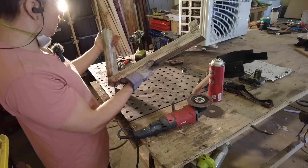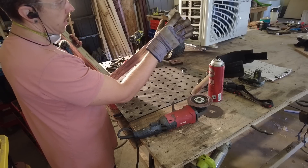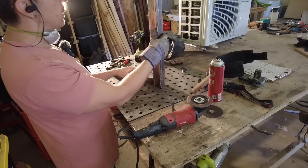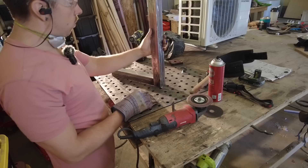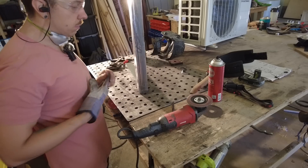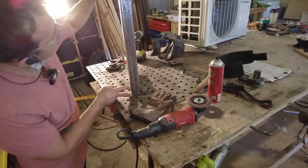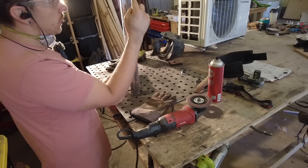This is what our completed bracket looks like — just a simple angle iron with a little backrest on the top so the unit can't flex backward in heavy wind. Now we're going to drill holes in the back, paint it, and then we're ready to mount. We'll go four inches in from the bottom to work around the aluminum frame of the box, since there's about an inch and a half to two inches of overlap, making sure we don't drill into that aluminum.